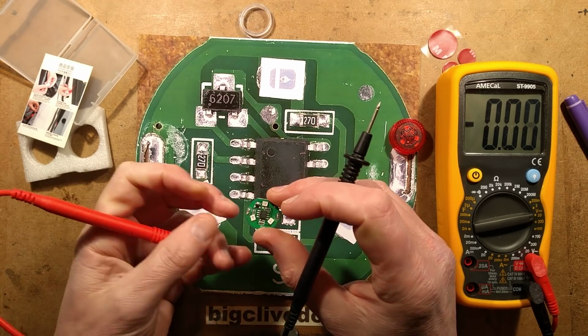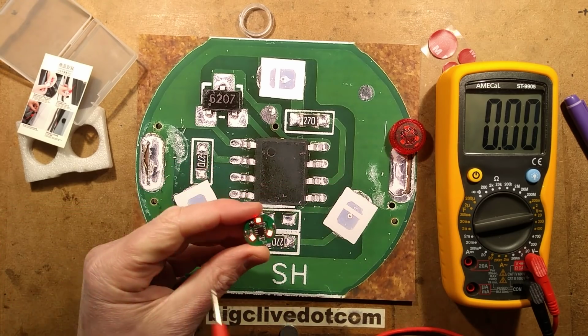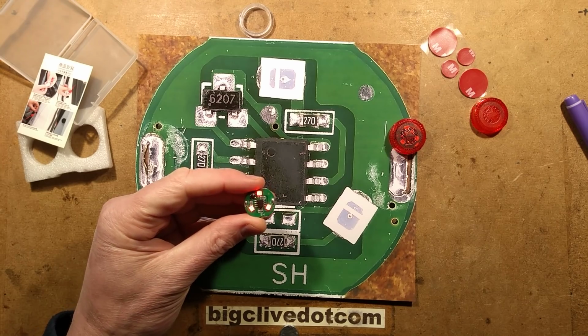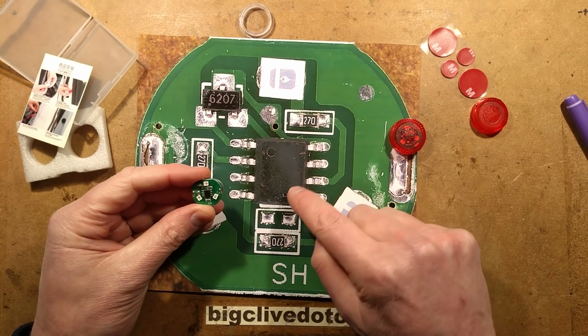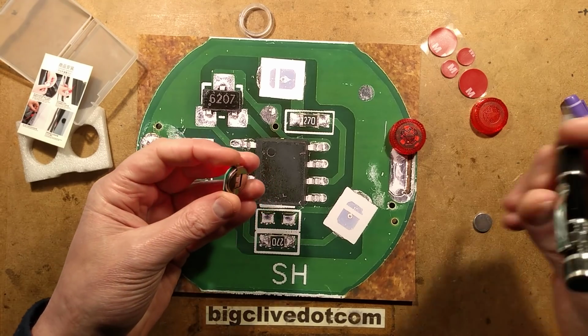So to activate, it goes into a different flashing mode. It seems to save battery. If it's left open too long, it goes into that mode. So to activate, it's going positive, but when the magnet's there, it's pulling that down. So there will be a slight pull-up resistor in here, but I wonder if that's connected over to there. I suppose if I pop the battery out of this, I can check that.